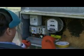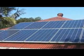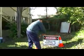Check for other sources of power supply coming into the switchboard, such as from a solar PV system. Now make a barrier near the work area to prevent normal public access. The barrier might be signage or tape to warn householders or visitors to the property about the type of work being done.